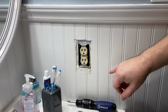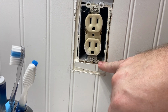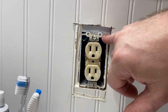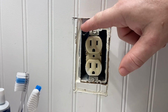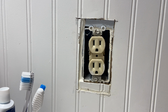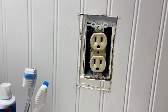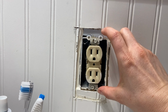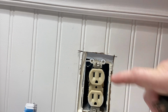All right, and as you can see, first mistake, this lip has to be above here, not below, behind. That's why it's behind. And of course, they cut it way too big. You see the box ends here? That's why the opening has to be the size of your box. So here we have to put something behind it to bring it up. I think technically it is a correct opening in terms of size, but he just put it in the wrong place and then tried to adjust it. If you look, there's this much here and then this much here. So had he adjusted it down, it would have fit more, but then it wouldn't have fit here. It should be exactly the size of the box. It shouldn't be bigger than the box.